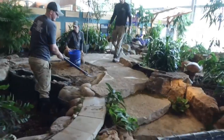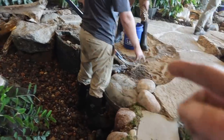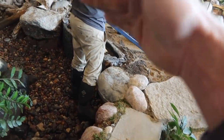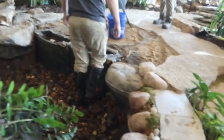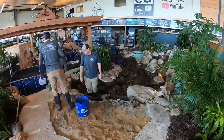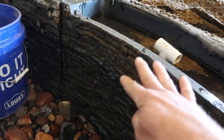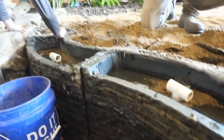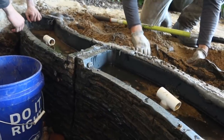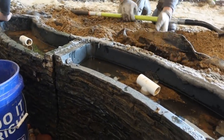We have more hands now - Jack, Dan and the rest of Team Aquascape up here just kind of prying up this patio, getting that area prepped and ready to go. When we pull out these walls we're going to end up having to seam the liner over here to give ourselves some extra liner to manipulate the shape back over here and make this pond bigger. Here are the two stacked slate walls that I was talking about earlier in the video. They were providing circulation simply by bubbling up just above the surface, overflowing and then pushing back across. We are still going to keep the circulation jets over on this area but these two walls are coming out and then we are going to be putting in a brick wall, kind of an opposite curve of what's happening, in order to make this pond a little bit bigger and create a better viewing area but also give us a foundation to lay that patio back on top of.